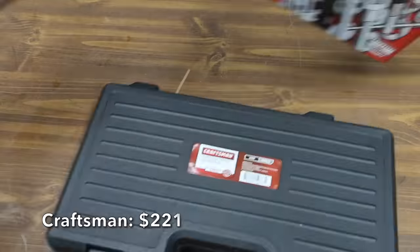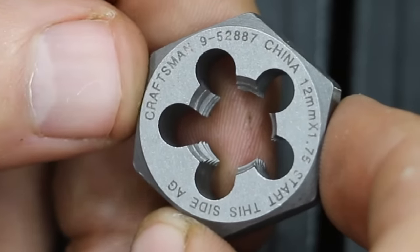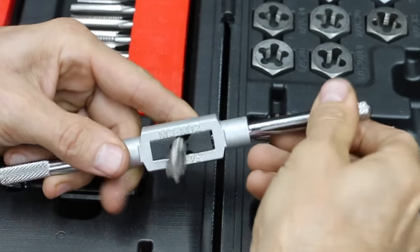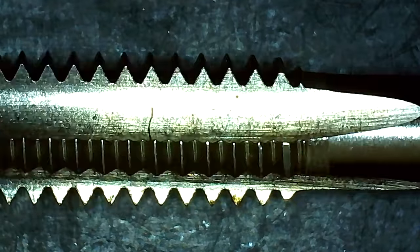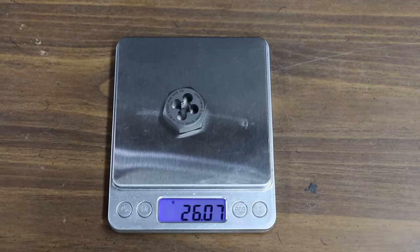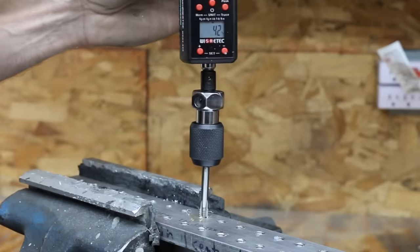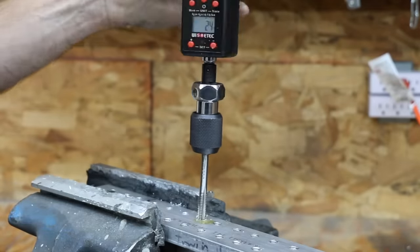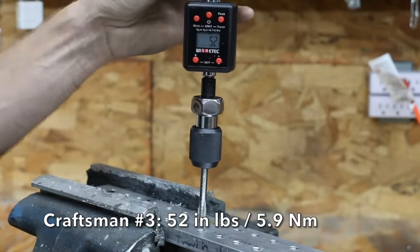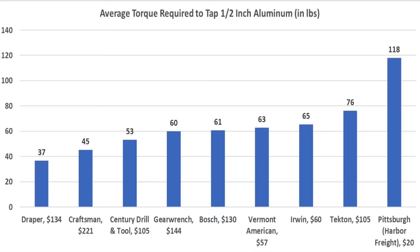At $221 is this Craftsman 75-piece tap and die set, the most expensive kit tested. It combines inch and metric sizes, features hex-shaped dies compatible with sockets and wrenches, and has hardened, precision-ground, and polished carbon steel surfaces for easy chip removal, plus a rust-resistant satin finish for smooth cuts with less friction. The Craftsman set is made in China. The tap weighs 13.64 grams and the die weighs 26.07 grams. For the 18-thread-pitch taps, the Craftsman required the least torque yet—42 inch-pounds on hole one, 42 on hole two, and 52 on hole three—averaging 45 inch-pounds. It also has very close to the same amount of side-to-side movement as the Irwin.